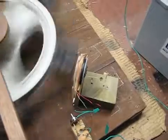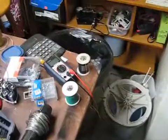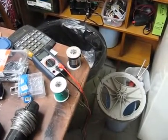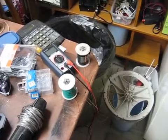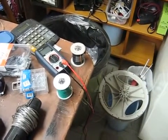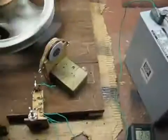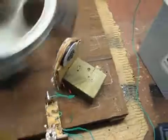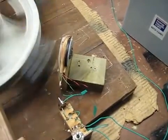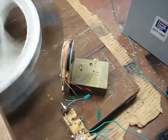The resistance in this coil is 25.8 ohms, as opposed to the bigger coil which was about 5 ohms. These are made with 23 and 26 gauge magnet wire, as prescribed. This one is a little smaller gauge — that's like 26 and 30.